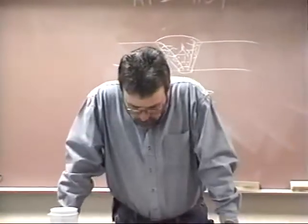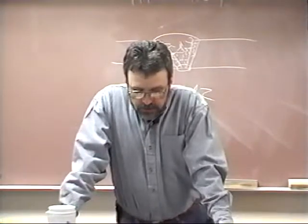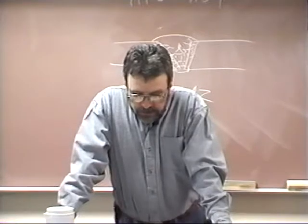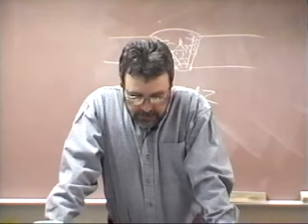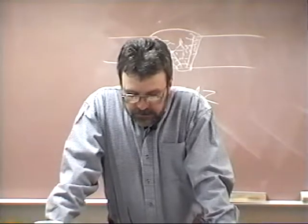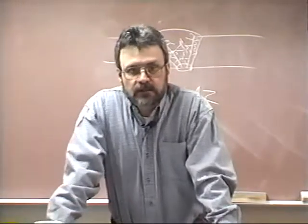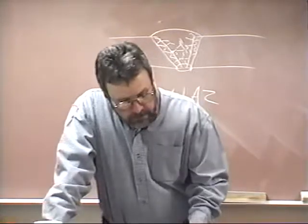Let's see, page 109. I want to draw your attention to figure 8.9. It says, position of the electrode for downhill welding a root bead. The electrode is buried in the pipe joint by holding it in the weld with a light pressure. The high current setting allows the arc to be maintained when the electrode is in contact with the pipe. You can actually dare it to stick. You can stick it in there and just dare it to stick. Go ahead and read that page.